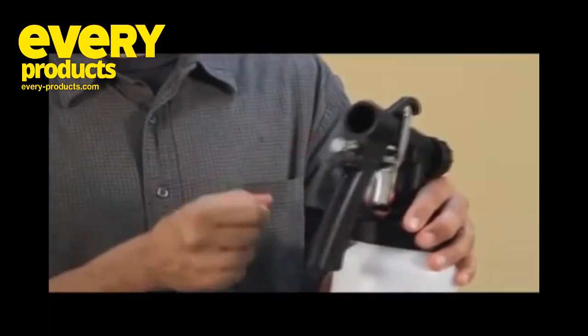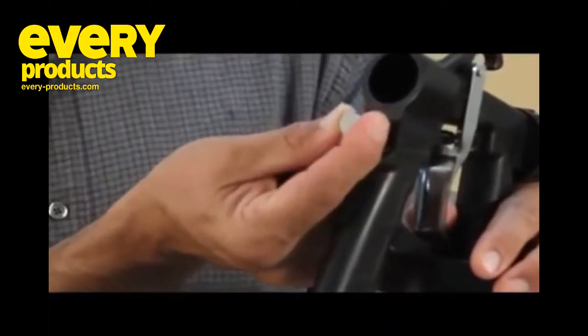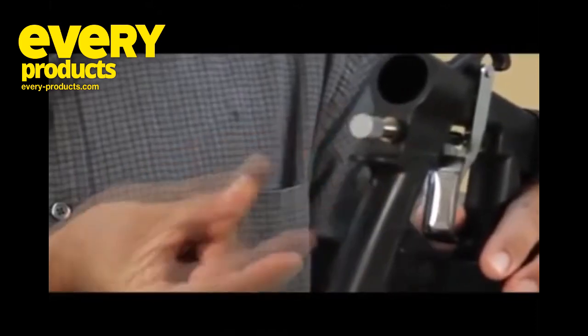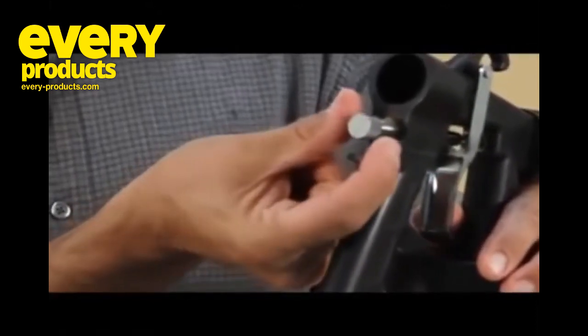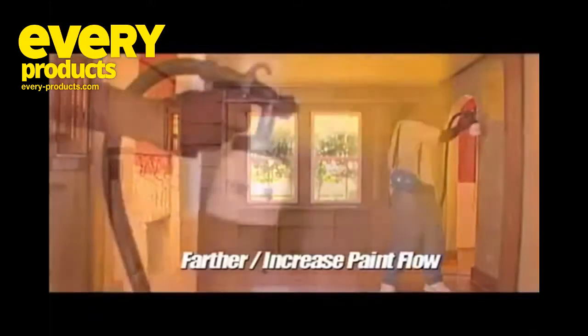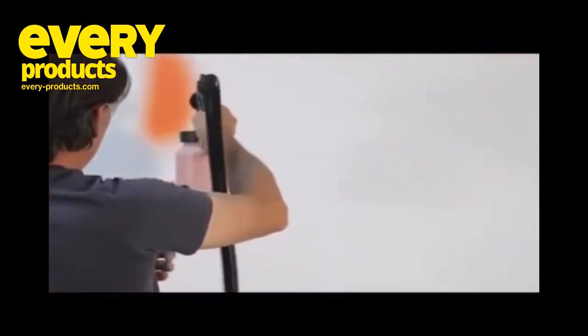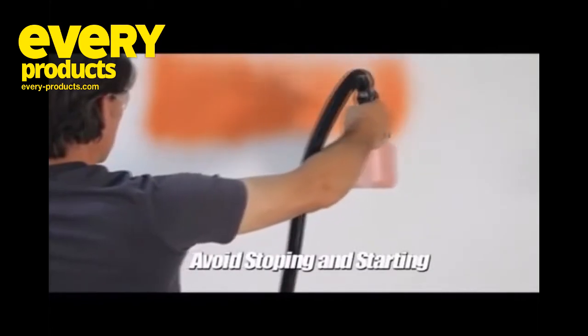This adjusts the intensity of the paint flow from the gun. You turn it clockwise to decrease the paint flow. You turn it counterclockwise to increase the paint flow. If you're spraying closer to your surface, your paint flow needs to be lighter. And if you're farther away, you should increase the paint flow. This will give you maximum coverage. It's recommended to paint in sections about 20 inches long, and avoid stopping and starting if you can.